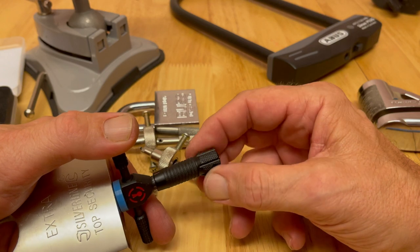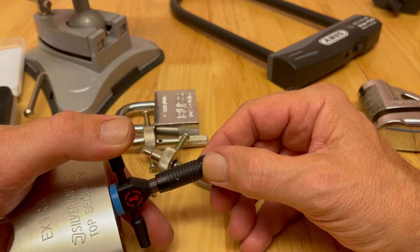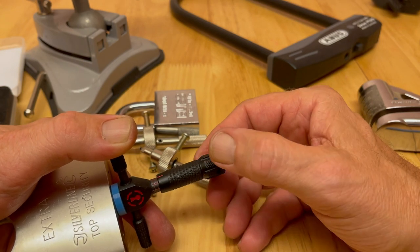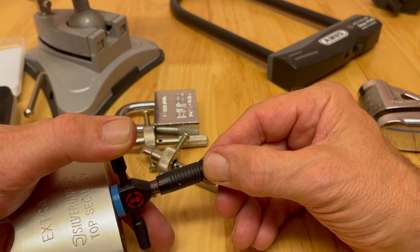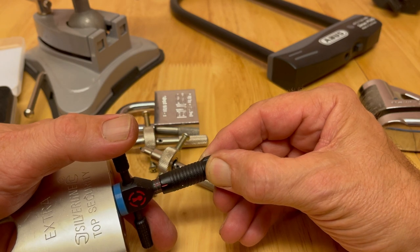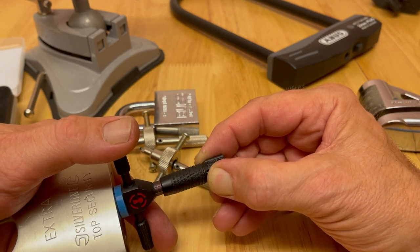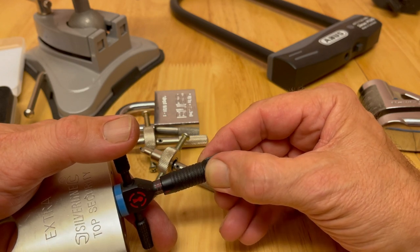So I'm going to go, we haven't picked anything here. So I'm going to go back to the bottom. I'm going to pick up that bottom disc. All right, so I've got quite a bit of movement on that disc. Now, I think that's in a gate. To check it, I'm going to rotate it around. It is binding heavy. Doesn't want to come out of there, so I'm sure that's a gate. Now I'm rotating it slowly, I'm not whipping it round, and it's binding all the way around. Nothing's fallen in, so I'm going to put it back.